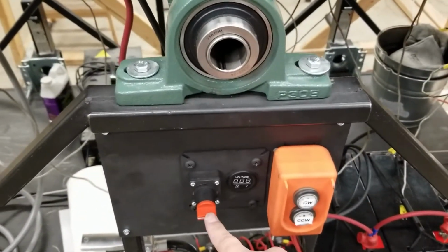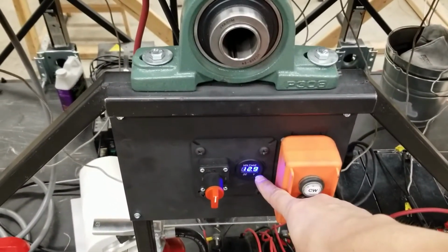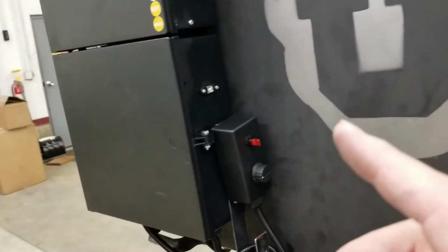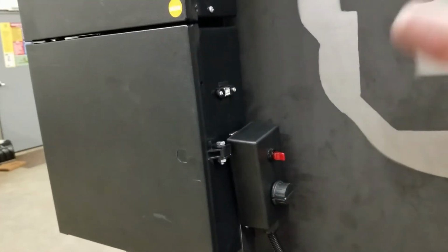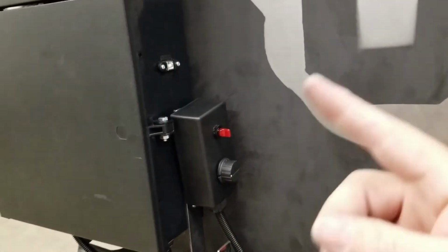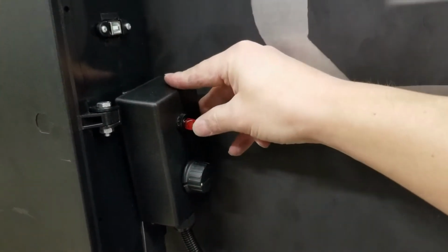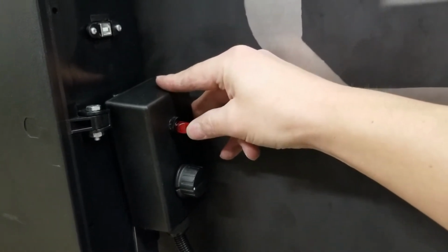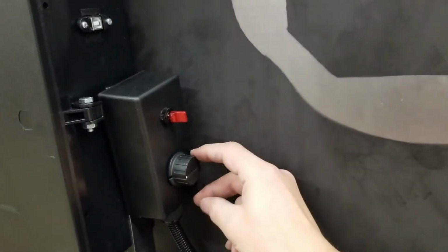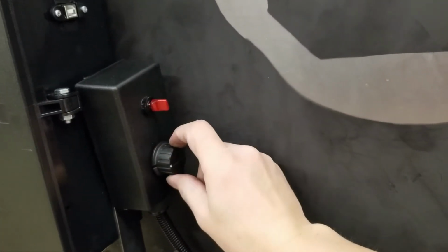Once selected, you have a switch to turn the power on, with a voltage display so you know how much. Beep beep is the signal that tells you that the fan array has armed. Make sure that you wait a few seconds after the beeps so that all of the array is properly armed. The current controls consist of a single switch to turn the array into a potentiometer control mode. Then the potentiometer needs to be completely zeroed out and turned up.